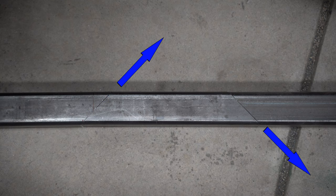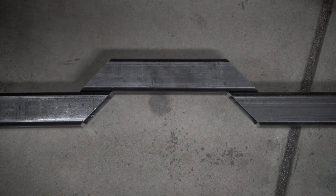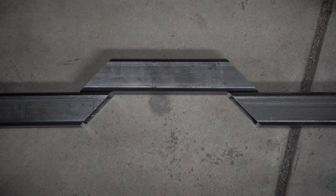I usually use two by four quarter wall tubing for the shopping cart handle, but since this cross member is only going to hold the top link bars, I'm going to use two inch square tubing with three sixteenths wall. The notch that I'm going to put in this cross member literally does not get simpler. If you cut tubing twice at alternating 45 degree angles, you can relocate the centerpiece up, weld it together, cap the ends of the tube and the cross member is done.